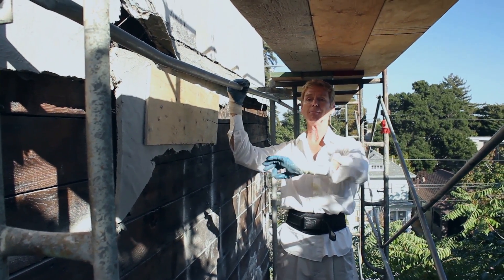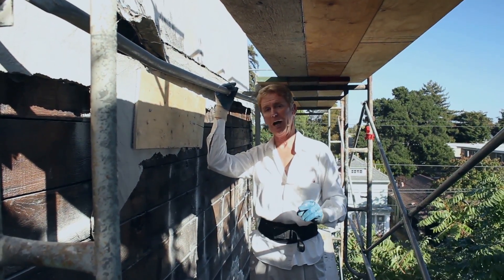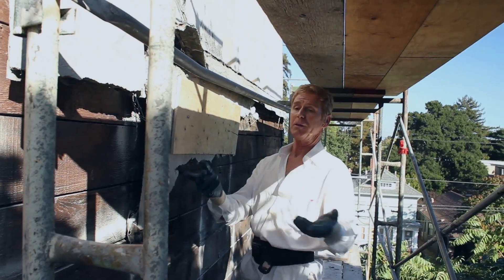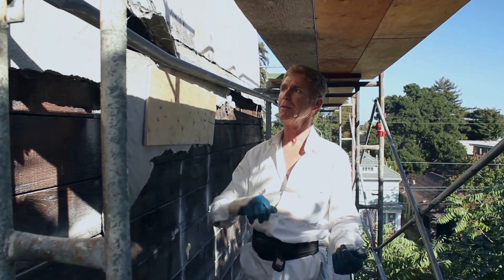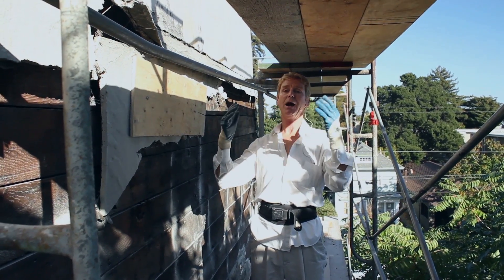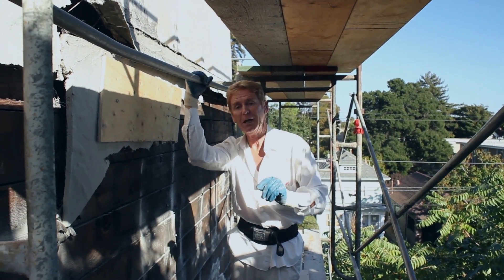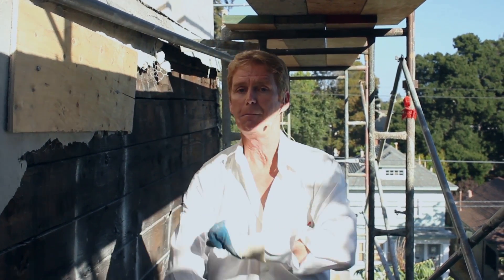This is a hundred-year-old building anyway. These folks asked me why, and my buddy Larry Billman asked me the same questions eight years ago. The scaffold guys are the ones who caught this because their six-inch pins couldn't even get through the stucco — it had separated that much. Unless you own an apartment or house that's pretty high up, you'll probably never experience this. Anyway guys, my name is Kirk, Jason's on the camera — we thank you for watching this explanation about failing fascia boards. Live long and plaster.